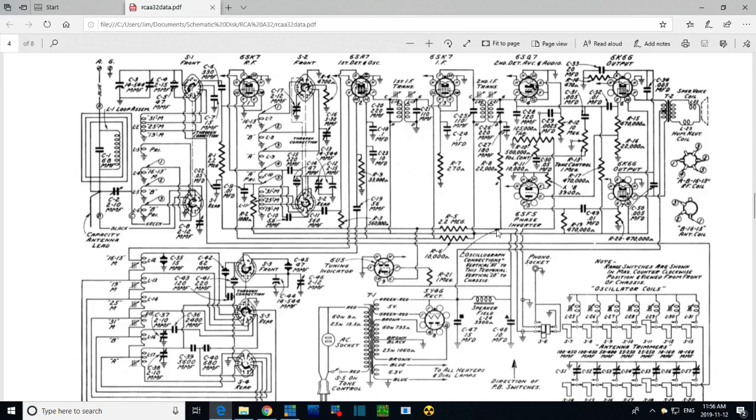I can measure back here, but if this voltage on this line is being pulled down, and by the way, if you pull this voltage down, this one goes with it. And watch out, I'm using the word down, but down doesn't mean negative, it means less in this case. So I measure here, I won't see anything that's happening on this line. So my only hope is to hook a voltmeter here, read what it is, feed in a signal, generate an AVC, stabilize the whole thing, shut it all off, change this capacitor, turn it back on, see what happened to that voltage. That's the best way of doing this.